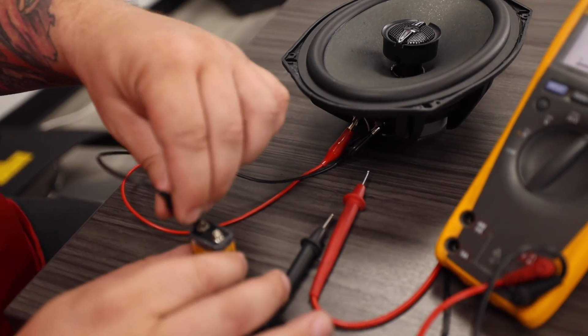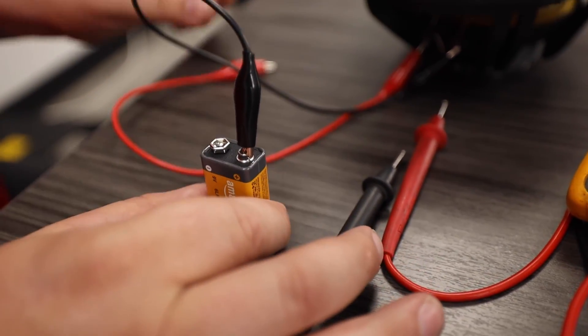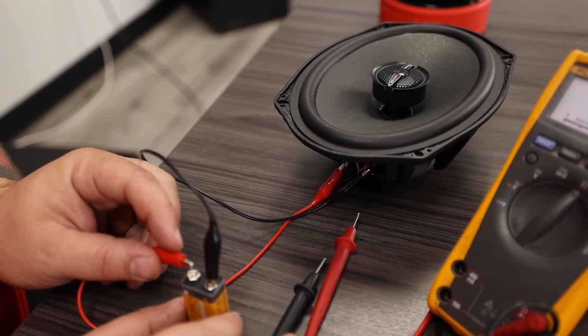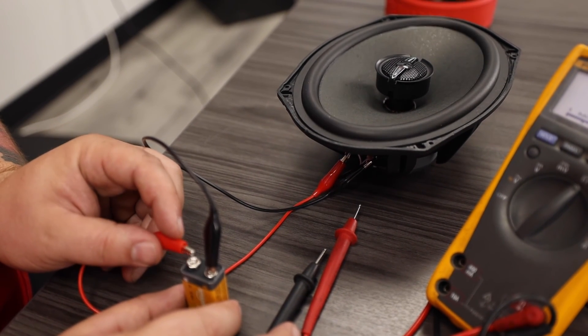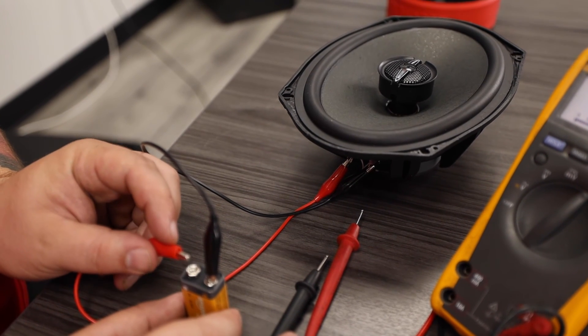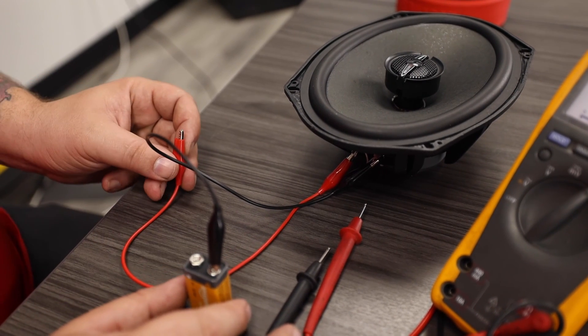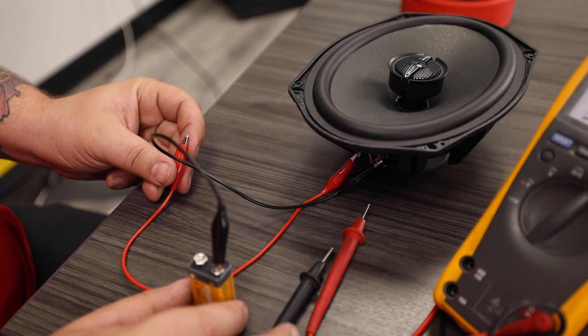This is a great way to tell what positive and negative terminals are on a speaker without knowing previously or having them indicated on the speaker. Now you may ask what would happen if we have them backwards — let's go ahead and demonstrate. We'll connect to the positive with our negative and tap our positive speaker wire onto the negative terminal. As you can see, the speaker pulls in as if it were moving backwards. This would indicate that the speaker is reverse polaritied and hooked up backwards. That's all I've got for testing a speaker. Thank you for coming — subscribe for more videos. Have a nice day.